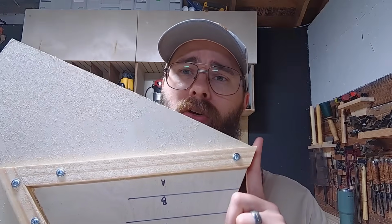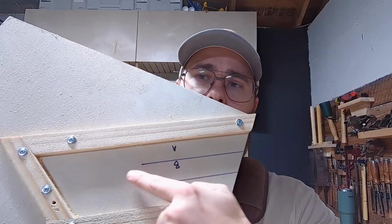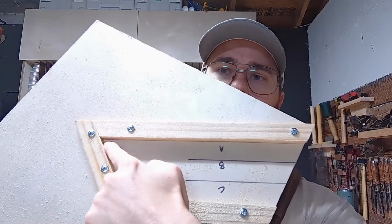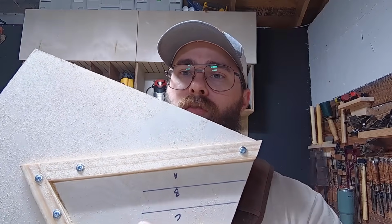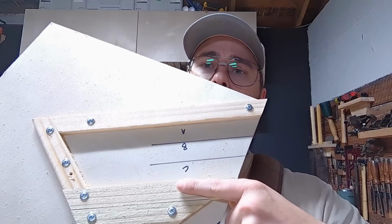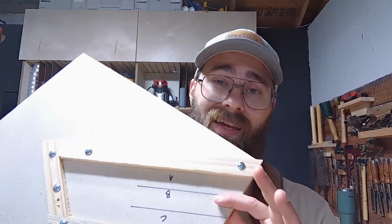It's set at a 30-degree angle to make the outside triangle. I'm going to run my first piece. I'm going to cut a matching 30-degree angle on the 1 inch by 1 inch strip. I'm going to butt that against this 30 degrees. Run my first piece, take the cutoff, stack it on front for the B section, run it again, stack it on top for the C, run it again. And you're going to see how to do that very shortly. This is going to make the process go by so much faster. And like I said, it is scrap wood, and it'll come out perfect every time.